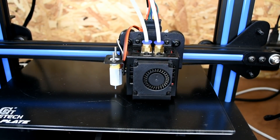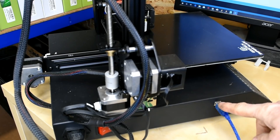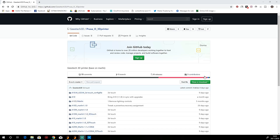The next thing to do is hop over to the computer and sort the firmware out. Connect the printer to the computer with the USB cable provided — it goes into the port on the side. Turn the power on; at this point your computer should recognize your printer. If it doesn't, I'll leave a link below to download the necessary drivers, but in most cases it should find it straight away.